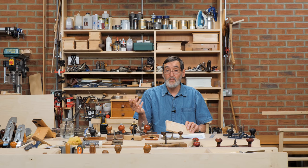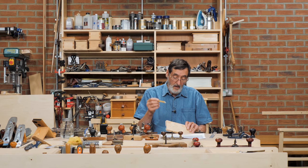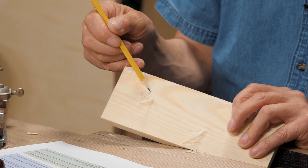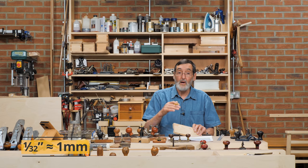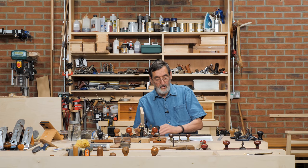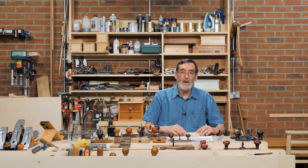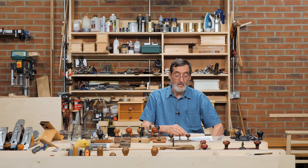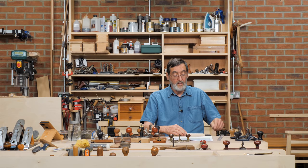Now I've got a super smooth surface across the whole area by simply using the corner of the blade. I use this instrument to tell me what's going on with the wood, then I alter my attitude — I alter the presentation of the blade, use the corner, and work through it. We've got a beautiful smooth surface now inside the bottom of the dado. It's always important to remember: it's not what you make that's important, it's how you make it, and that's going to determine the outcome.